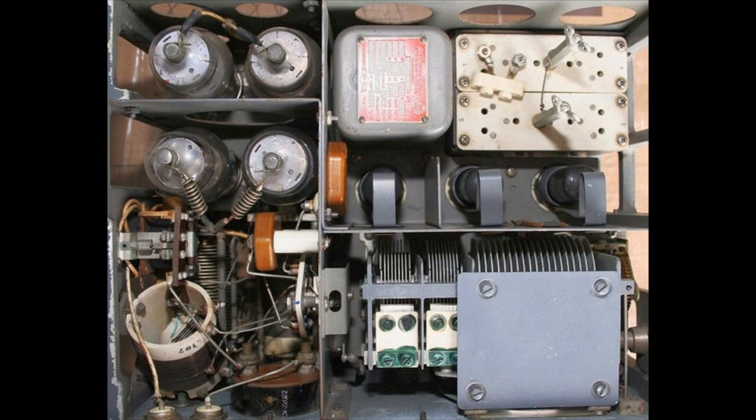There's a photo — top view inside the transmitter. There are four 1625 valves altogether, as you can see — the big valves. The modulator is two 1625s in push-pull, class B — rather nice, anode and screen modulation, or plate and screen if you're in America. And a couple of 1625s in parallel for the PA, the transmitter PA.